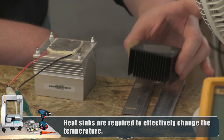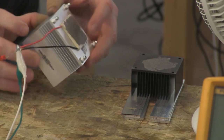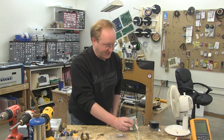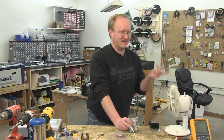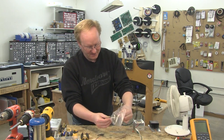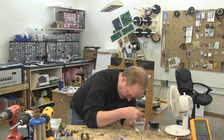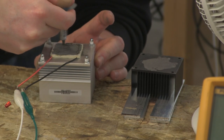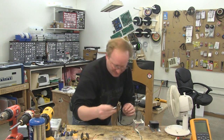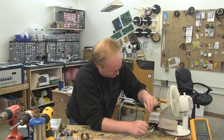We're going to use this heat sink to represent our light and attach it to the Peltier. On the other side we'll have another heat sink that's actually going to pull the heat away and disperse it through the air — the fan will help with that. Hopefully we don't need a fan, because that would also take electricity and kind of defeat the purpose. I'm going to use some Arctic Silver CPU paste to give us a good bond. We'll probably use something more permanent like JB Weld for the final thing. Let's hook up this LED as well just to see if we get something.